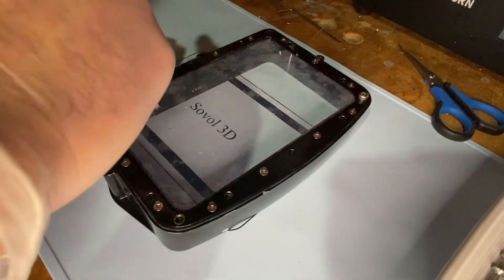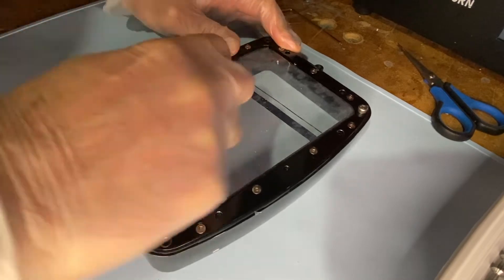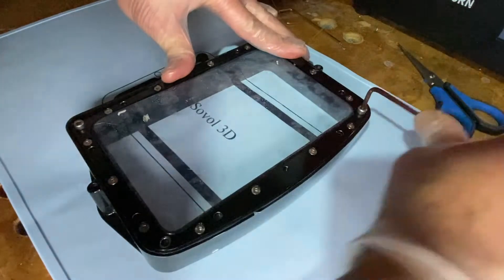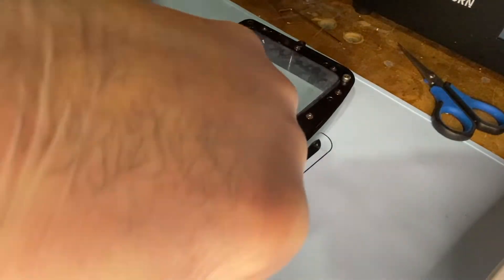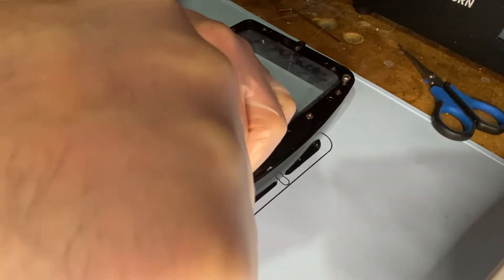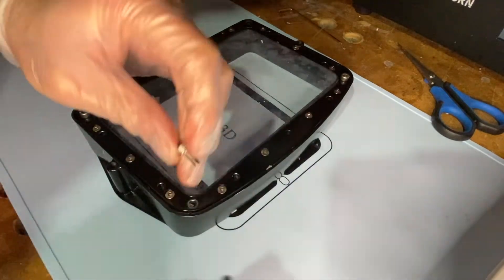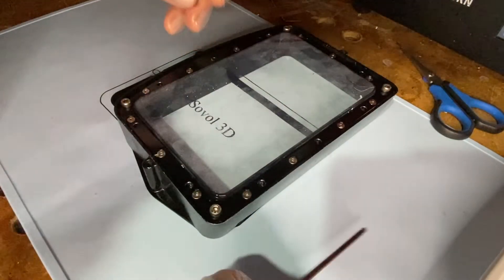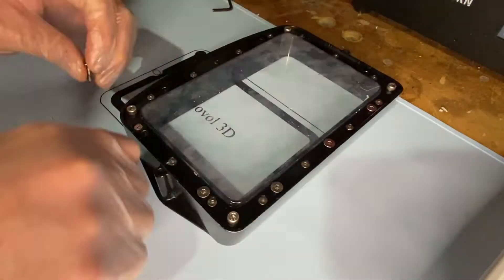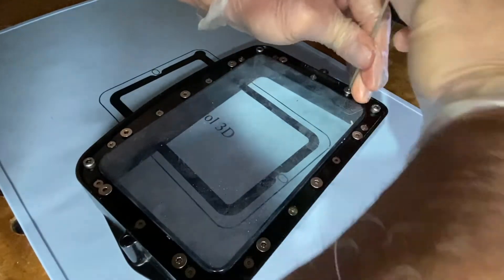This is causing all the tension now — the film is spread out. We're going to drive these down and get it really taut. This is just with two of them and you're going to hear how taut this got. That's a good way to tell if your film is taut — listen to the sound. It almost sounds like a drum. The tauter it gets, the sound changes quite differently. Now we're going to drive this corner in and start with our middle screws. You've got a lot of screws here but it goes pretty quick — roughly about 10 to 15 minutes depending on how comfortable you are.